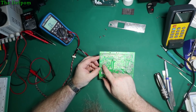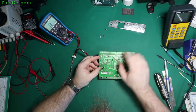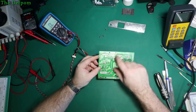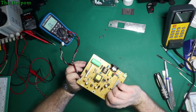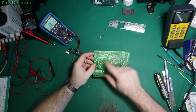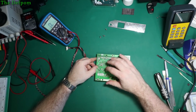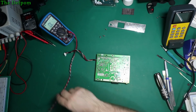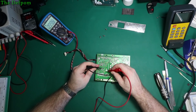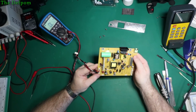So with DC coming in here, that leg of the chip, and over to there, which has got a jumper wire, comes to here. So the common negative is going there. Got diode that side, diode that side. Sorry, resistor that side. Let's check and see if that resistor's got any resistance or not, in case it's opened up. 100K, that sounds like a reasonable value. It's marked at 100K, so yep, that's fine.